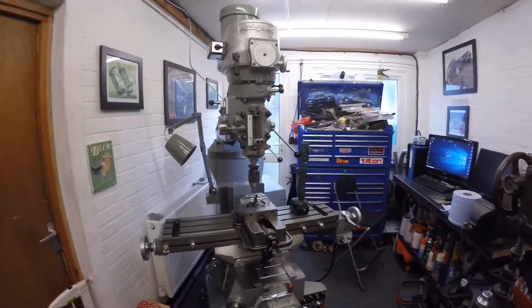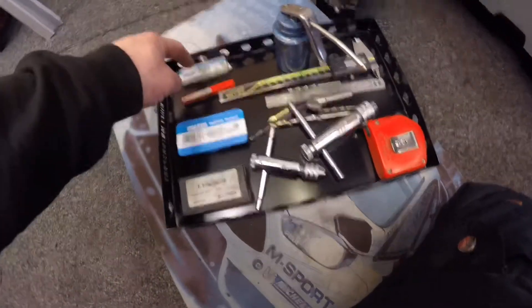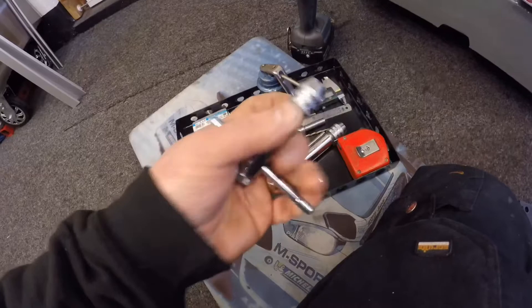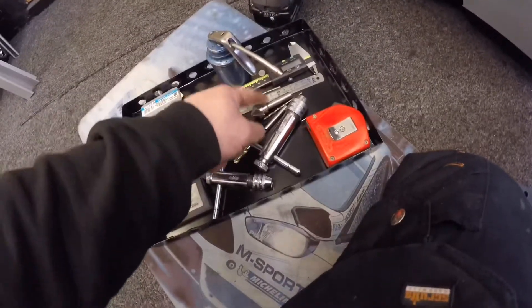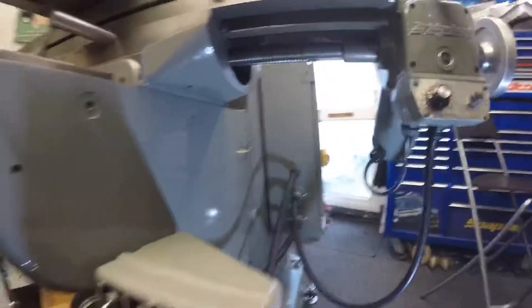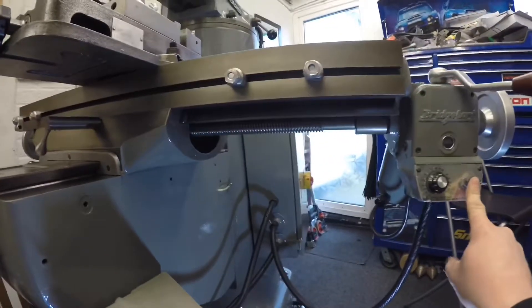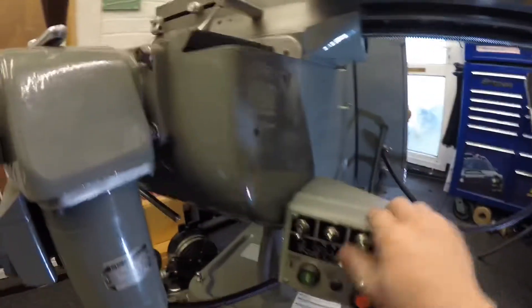I'll cut the videos and put them together so you're not watching too much boring stuff. We've got a tray of bits ready to drill and tap the brackets. Pretty much all you need: metric taps M4, M5, M6, and M8, drill bits, ratchet taps - that bigger one for the M8. Just some cutting oil and a tape measure. We'll get ready to put this bracket on there, but move the table out of the way because you've got to get under there with your drill. Center punch, drill, and tap.